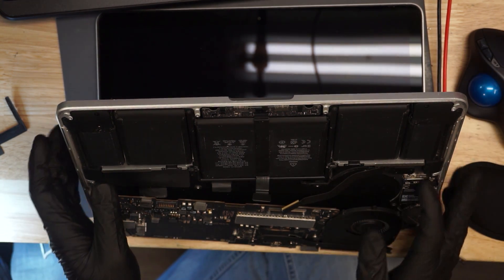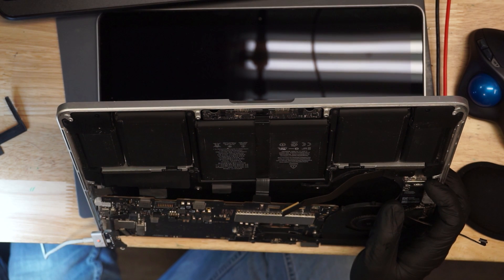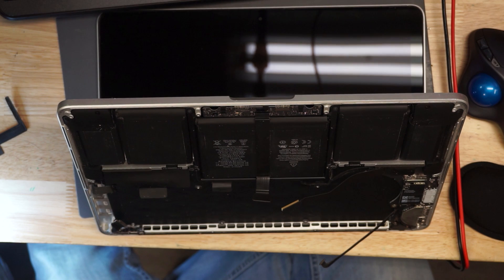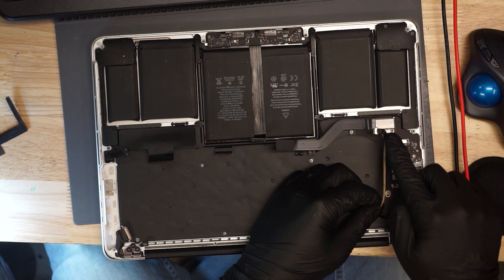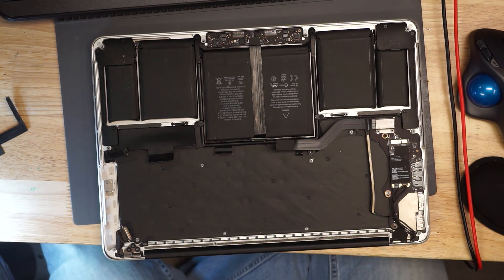Let's see if we have a light on this MacBook. And we do! Look at that — a backlight! So those caps were shorting my backlight circuit to ground, and after replacing them, it works. Now, why did this fault happen in the first place? My best guess is somebody replaced the screen, and the MacBook got mad at them for it. As can be seen here, this screen has fresh adhesive on its webcam wire, meaning somebody most likely replaced the screen before. Rather than the fuse blowing, the backlight caps exploded — because it's a Mac. With that, we're going to move on to the next MacBook.